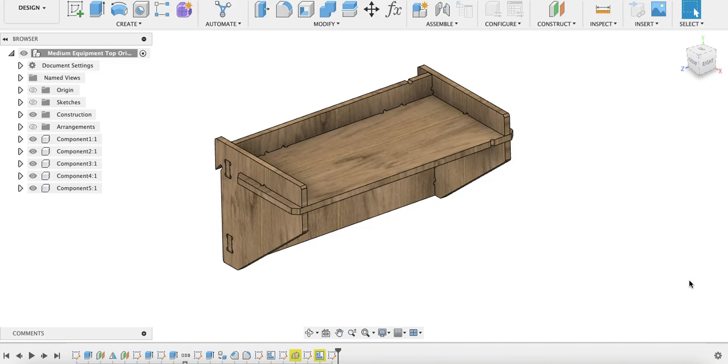Another important item that I've experienced is not to remove too much material with a single pass. So my designs are all intended to use either a 1/8 inch bit, or I've also used a lot a 1/4 inch compression bit. And I found that generally sticking to the rule of thumb of removing half the diameter of your bit, or in my case, I like to do slightly more than that, with each pass, was a good rule of thumb for more accurate cuts.